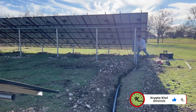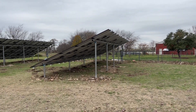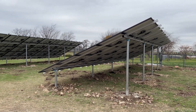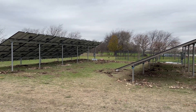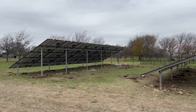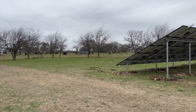Now they're ready to turn it on — last bit of wiring is happening and then it's all going to be fully wired and ready to commission. Today is cloudy but the system is fully commissioned. The monitoring and reporting stuff on the Enphase inverters isn't quite fine-tuned yet, but it is generating power. I've got a Sense monitor connected to the cables that feed back into the house, and right now I can see it's producing around five to six kilowatts even with this much cloud. I did see it spike as high as eight kilowatts. It still works a bit even when it's cloudy, and it's nearly the shortest day of the year, so I'm at one of the lowest producing days there is.